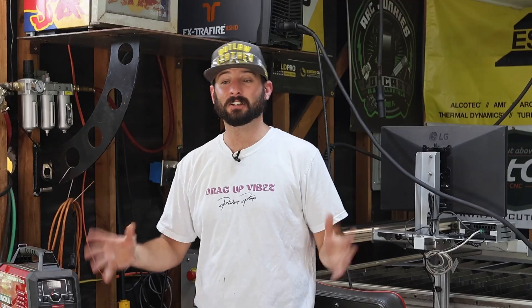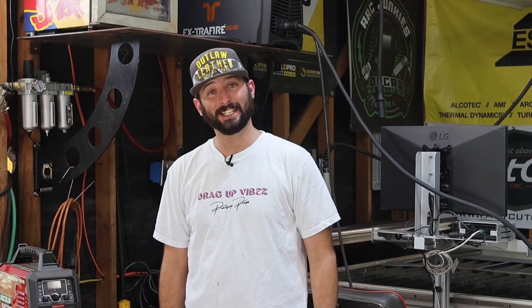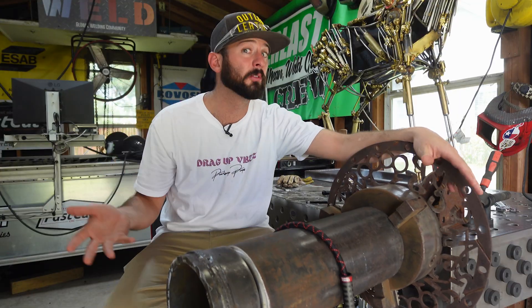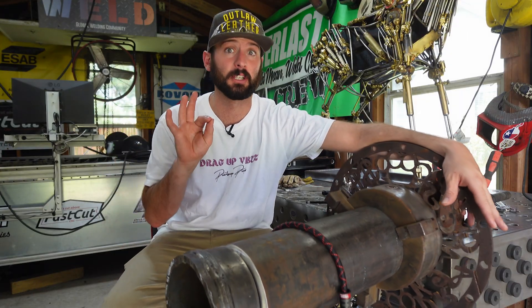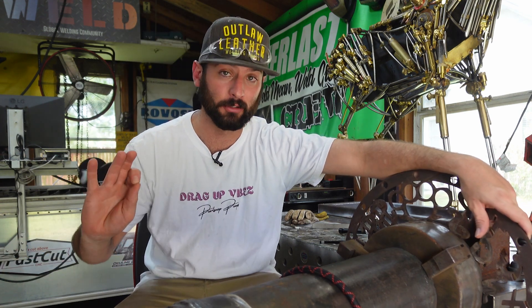Now that that's all said and done, let's get into today's piece of pipe — and golly, is it bad. If you're new to TIG, maybe you're getting into welding school and you started on plate or maybe you're moving into pipe — let me give you this tidbit of advice: focus on your prep, focus on your fit. You will learn a lot easier on a good prep and a good fit. My personal preference on fit in any position TIG welding on pipe is a 5/32 gap, no land.